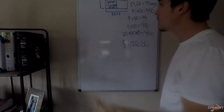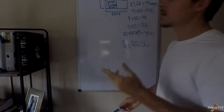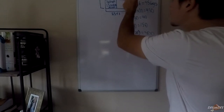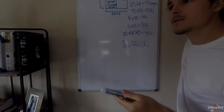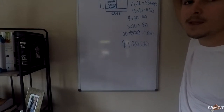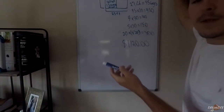That works out to nine cubic yards total for the entirety of the shed. Now with the cubic yards known, let's convert our mix ratio into how much material we need. I know it's four inches thick and I want to do a mix ratio of 1:4:5. That's actually slightly lower than an M10 grade — maybe M8 or so. It's plenty of PSI for the light use I'm going to be doing in there, maybe 2,000 PSI. Very cheap is the goal here.